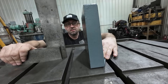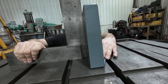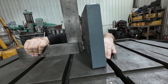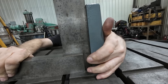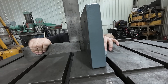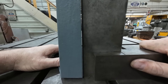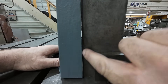The first thing I want to do is line up the camera nice and take my little square here — it's a little one — and just see. On the boring mill table there's some gap in there. I don't know if you can see that on camera but there's a couple of spots. It's not true at all. It's really bad on this side. Bigger gap down here and this side is a much smaller gap. You can see some light through here. Pretty bad right there, but it's still good up here. Then when we come down to this end it's touching here, and at the bottom it's got a gap but it's nowhere near as bad as that other side.